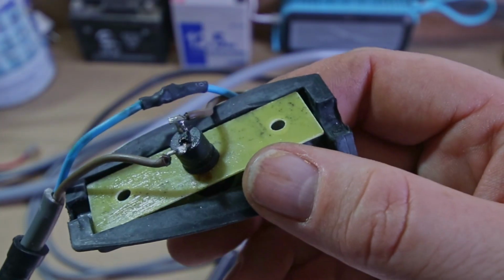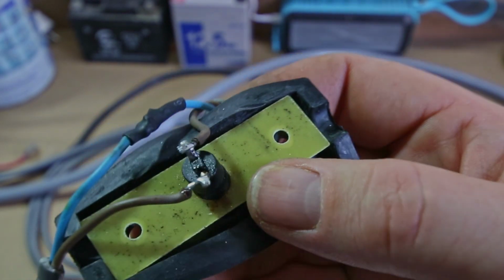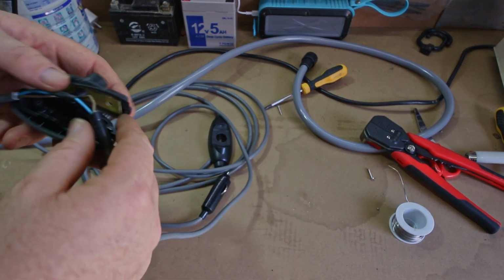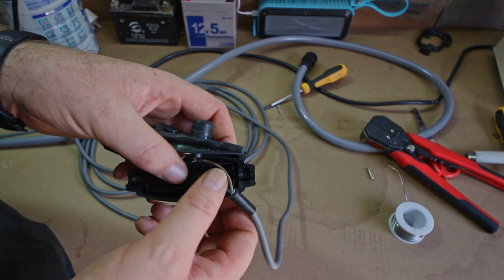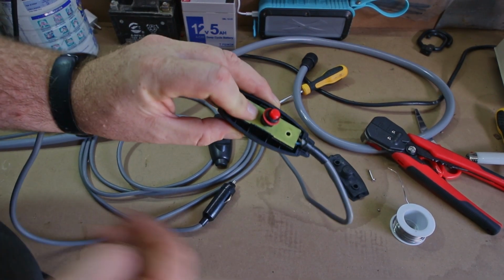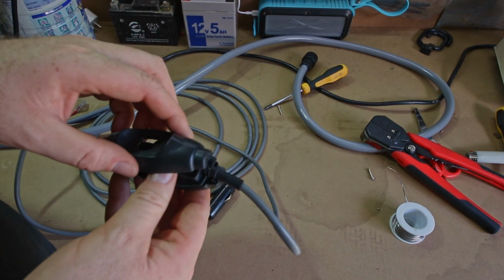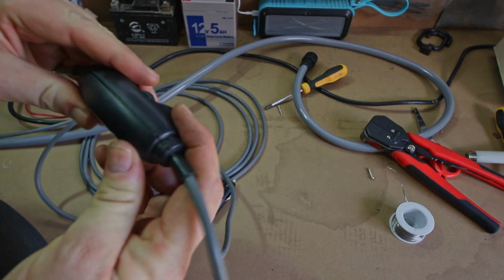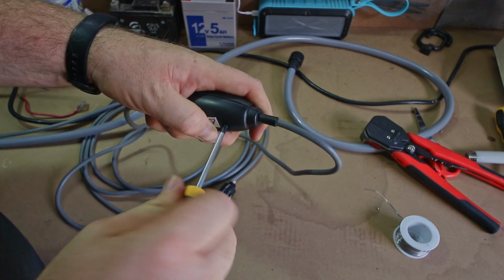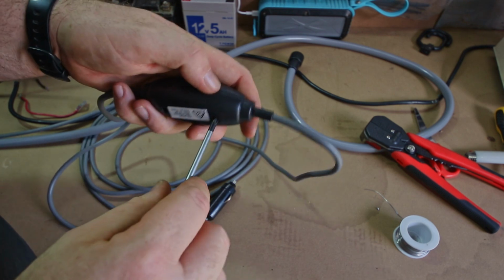Yeah, it's soldered back on. Comment below whose solder's better. Mine's the bottom one, super cheap's the top one. When you're putting it back in the switch holder, just make sure that your wires go each side of the screw. You don't want the screw going through the wires. Nice and simple like so. Waterproof boot back on. Plastic cover. Screws back in. Don't over tighten them, but tight enough so it seals.